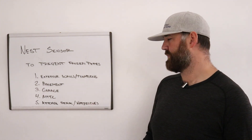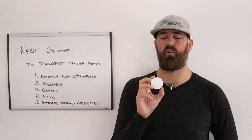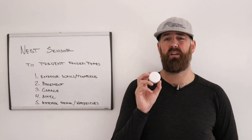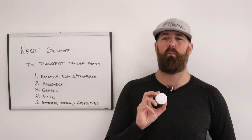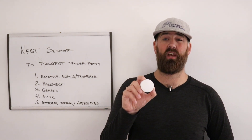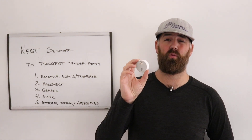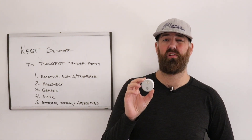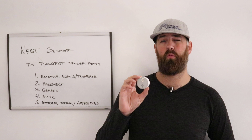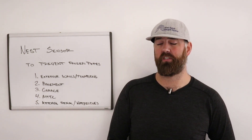The first place is in exterior walls or near plumbing in exterior walls. The reason for this is because an exterior wall is where your pipes are going to get the coldest. If you can put this actually in the wall, that's best. If you can hang it on the wall, that also will work. But you want this to be as close to the pipes as possible so it represents how cold those pipes are potentially getting so you can prevent them from freezing.